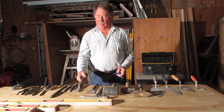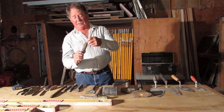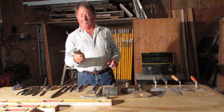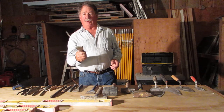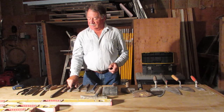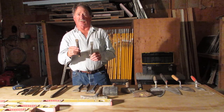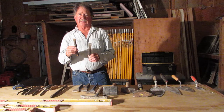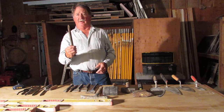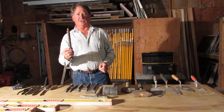When you get to cutting stone you use a chisel like this — this is a carbide tip chisel where the very cutting edge is an inset piece of hard carbide in a mild steel frame. These are used on all manners of different stone and there are all sorts of different types of carbide chisels. You can also use a point chisel for taking off high spots in stone or wherever you need a discrete, direct impact.